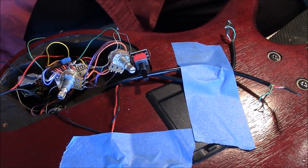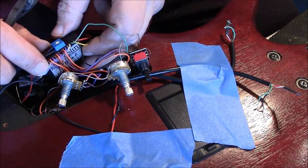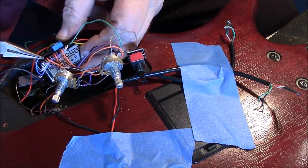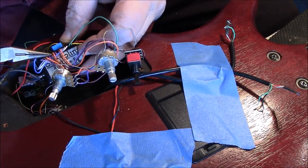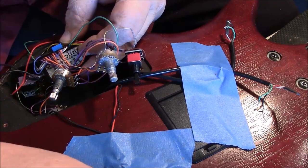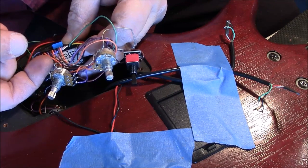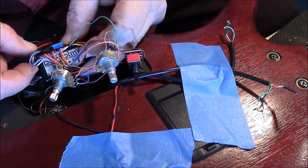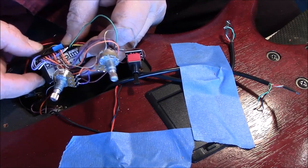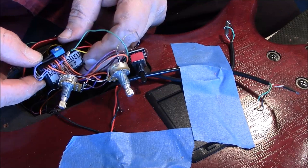On a very close inspection, I see a problem with these wires that lead to this little board here. I see a lot of crimping, and I see some of the insulation has been cut into. This purple one, this orange one, this blue one, damn it. They've been cut into. I don't know if that's going to cause any problems.